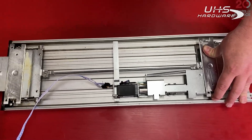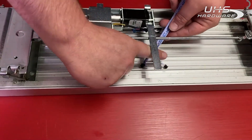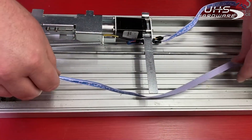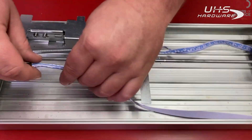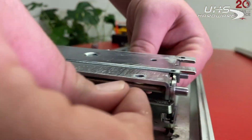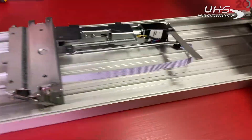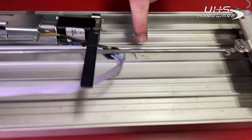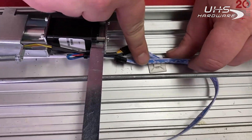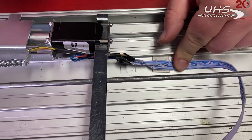Make sure that the base of the motor kit sits flush with the back activating bracket, and also make sure our rear mounting bracket is sitting on top of the connecting rod. Now we're going to run our remote module cable underneath the connecting rod and back through the back activating bracket opening. At the back of the device there is a mounting pad with a zip tie to function as a strain relief for those wires.